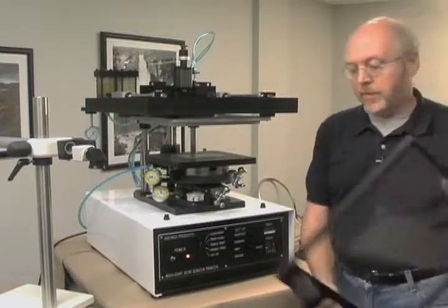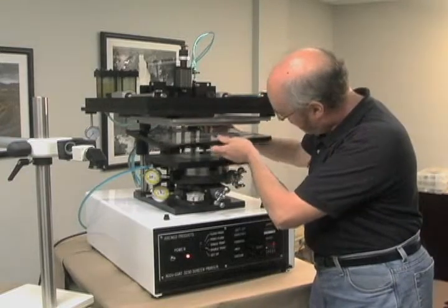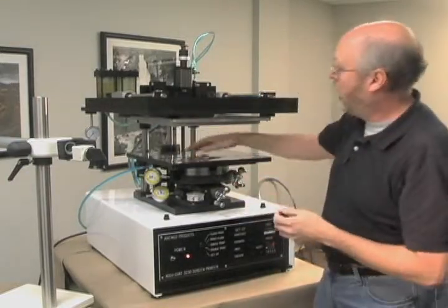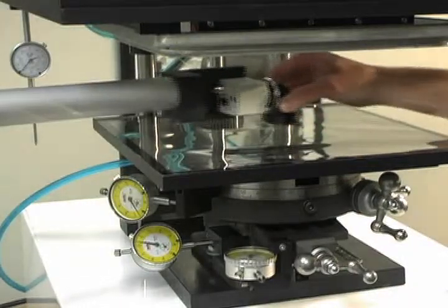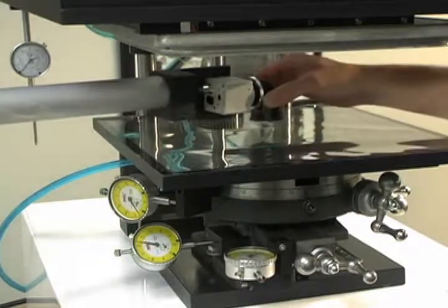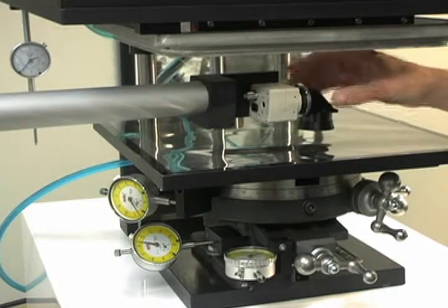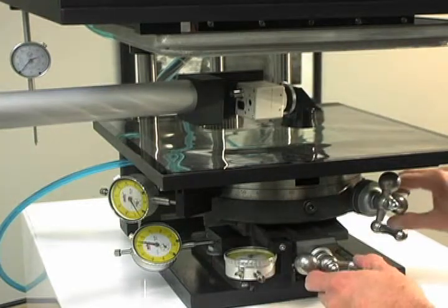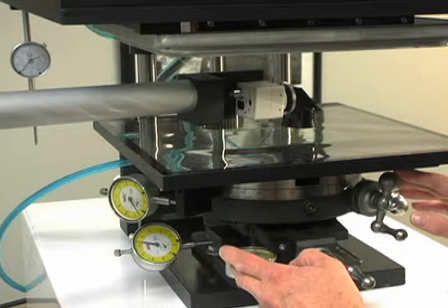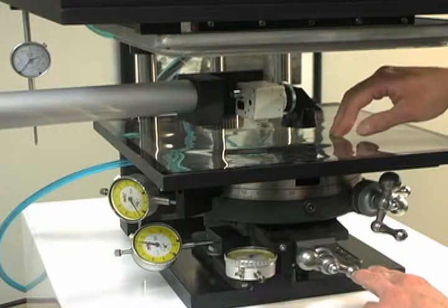Also with the Mylar screen frame, it easily mounts onto the machine on the two posts on the back and comes down. To visualize this more easily, I have a camera. The camera system will slide in and under. It will move forward and back, and in and out, and allow us to visualize the work surface on a monitor. From there, with a 10x magnification, using the X, Y, and Theta, and the dial indicator package, alignment of the Mylar screen frame to the work piece can be easily accomplished.